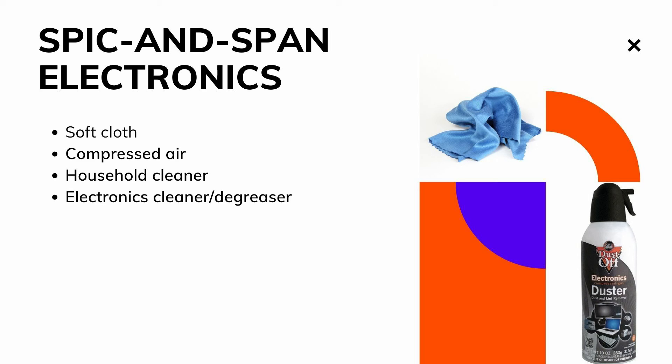You can buy both light machine oil and synthetic grease at any Radio Shack store and other electronics stores, as well as many music, sewing machine, hobby, and hardware stores. A warning: some mechanical components don't require oil or grease, and in fact some pieces can be harmed by lubricants. Certain self-lubricating plastics can actually break down if you expose them to a petroleum-based lubricant.